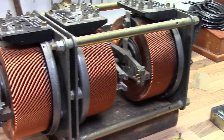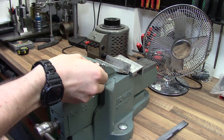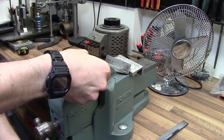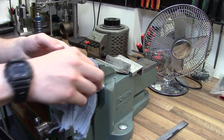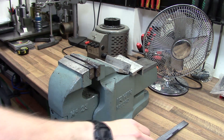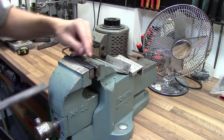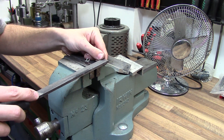So let's rotate to the vise. I'm going to lock this brush in the vise now. I've already got lots of carbon over the vise from the last one I did. You've got to be ever so careful when you lock the brush in the vise because they are brittle and they will just break. So it's just a bit of feeling it as you tighten it up — when it stiffens up that's when you want to stop. Don't go any more than that because you will crack it. I'm going to take the shoulder back and leave about four or five mil on the end.